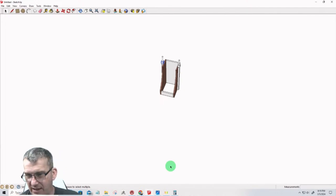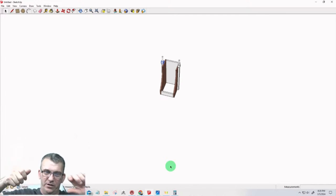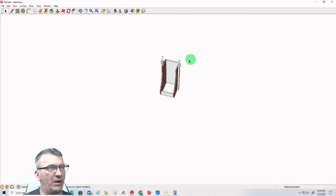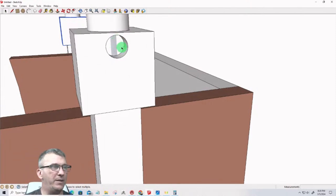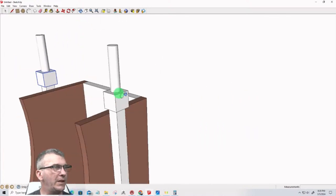I got a question here. It says, is the nut hole bottom still in the round part of the block? Not partly in the square part, right? The hole is just in the round part where the screw comes in and puts pressure on that pipe that's sliding up and down. It puts pressure on the pipe to thread in and hold pressure against the pipe. If I go down into the square section, there's too much of a gap there. So that hole is just within that half inch section at the top, that's all circular, right? All that meat there. And then below that is the square part.